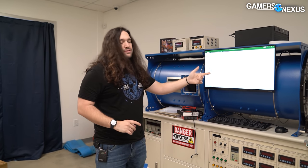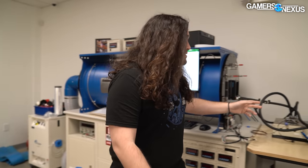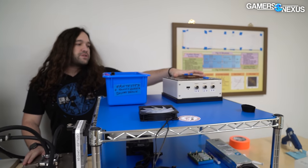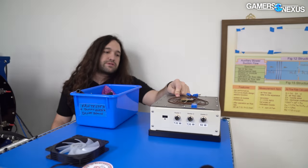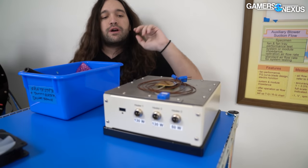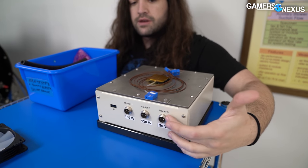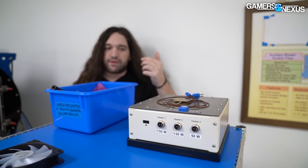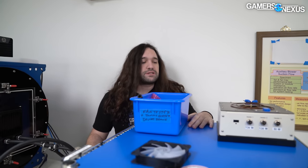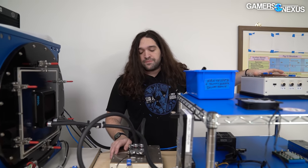We're doing PQ charts, but I'm going to condense them down into bar charts that are comparative between different fans. We're also adding thermal testing. This is a dummy heater — we had these built custom a while ago. This one up here is an AMD Ryzen one we custom engineered with the company that built it. It's got three different resistive loads in it — this one simulates a Ryzen three-chiplet design. You can power each chiplet individually. You could do a two-chiplet design like a 3800X or 5800X, or three chiplets for a 5950X simulation.